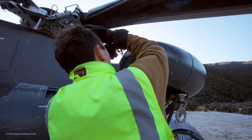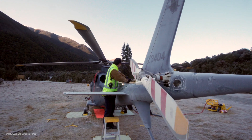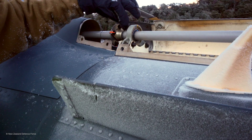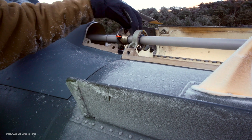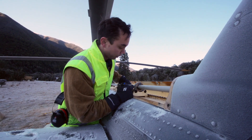We've got something on the end of the line. We check the tail rotor bearing — rotor's turning — just making sure that they haven't flipped. Here I'm checking the hanger bearings. We've got slippage marks on the inner and outer race of these bearings, and we're just checking to make sure that these haven't moved from the previous flying.